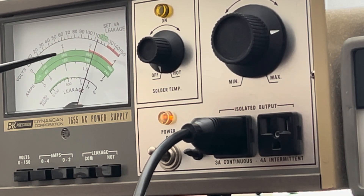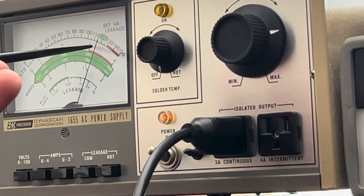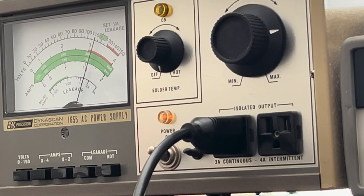Focus on this needle here. The tube heaters drawing current should show up as a dip in AC line voltage, so let's see if that's the case. Spoiler alert: it is the case that despite the power indicator turning off, the amp is still drawing current. It's only recovering a couple of volts as the power indicator turns off. The tube heaters are certainly having a good time.